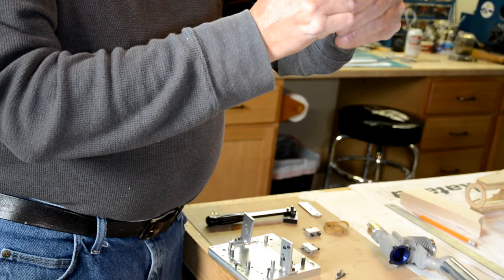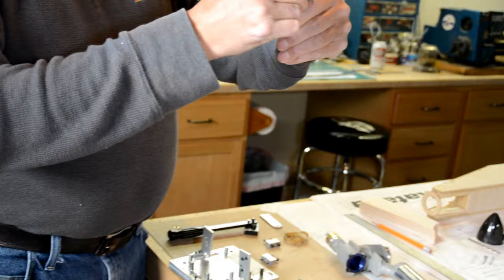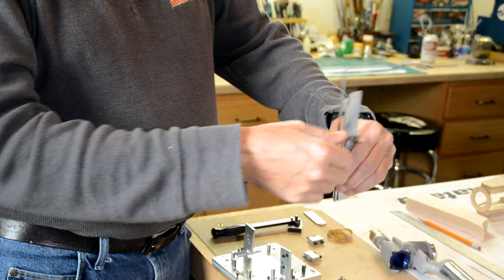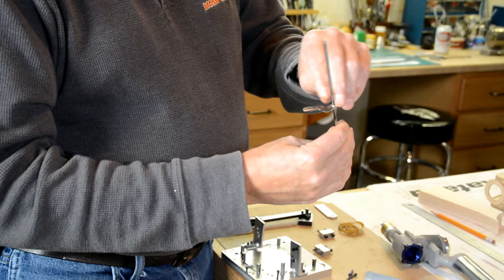Take a little piece of copper wire up here, top and bottom, that holds everything together. This is in a vise clamp of some type. Your little solder ring goes down on there, and then you heat it up, solder it, and then you end up with basically a real nice little horn. It's got a very clean, strong solder joint.